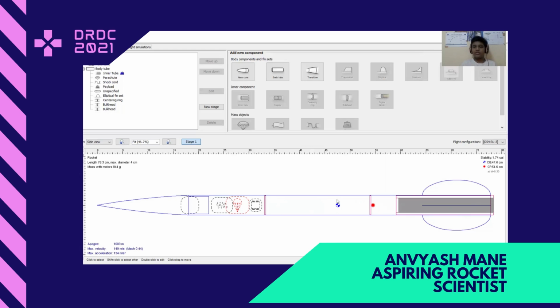Then this is the static margin, as I told. The stability is 1.74, it's stable. CG is 47.6 centimeters away from the tip of the nose cone. Its CP is 54.6 centimeters away from the tip of the nose cone. And after that, bulkheads. And there is a small centering ring at the back, if you can see in the 3D finished model.